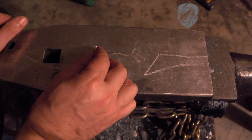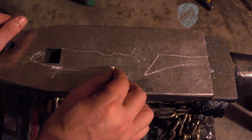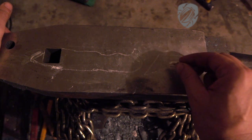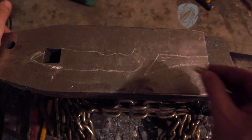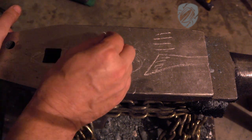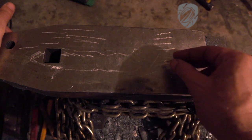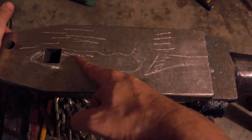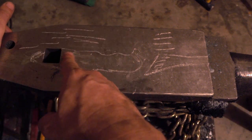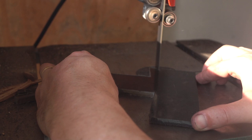And furthermore, there's a little more evidence to support that. This is sort of the layout of the steel that I used. The kiridashi was the spike over there on the right, and then the area just to the left of it was what the knife was made out of. And the lines and voids are oriented in this direction, which is perpendicular to the blade on the kiridashi. But on the knife, they're oriented parallel to the blade, which I wouldn't really think would be the case if there was an error in heat treating or forging.